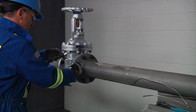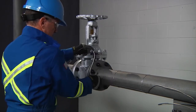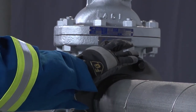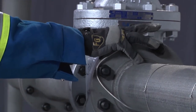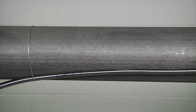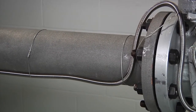When approaching a heat sink area on the pipe, such as a valve, flange, or pipe shoe, ensure that you refer to the design documents and reserve the required amount of cable to be applied around the heat sink area. Bend the heating cable around the valve, flange, or pipe support as shown in order to ensure that the correct amount of heating cable is applied. When using XMI-L heating cable, similar methods are used to attach the cable to the pipe using the tie wire.